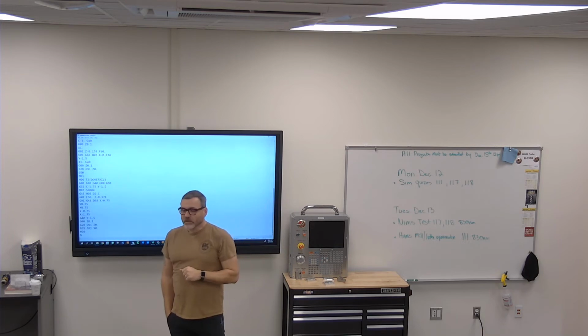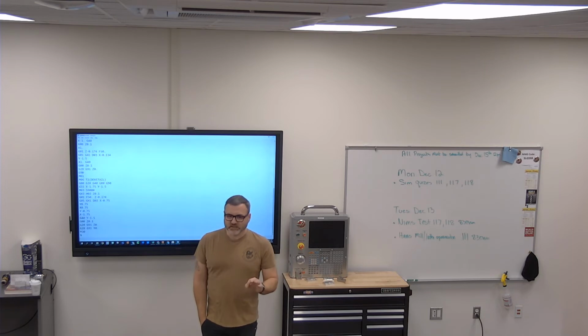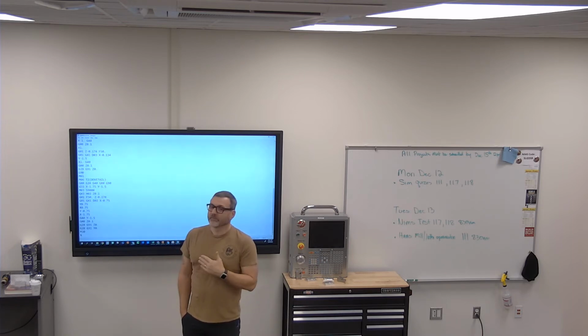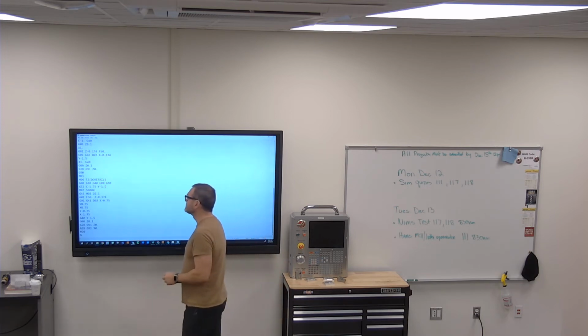Another thing that you could do is a G53. You could do a G49. There's a couple of different ones. G28, G91 works on all machines. Like with anything, you can make spaghetti 15 different ways. You can CNC program probably 30 different ways. So there are the most common ways. And then we come back down for the tool.